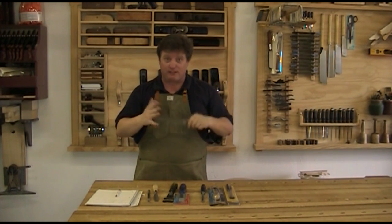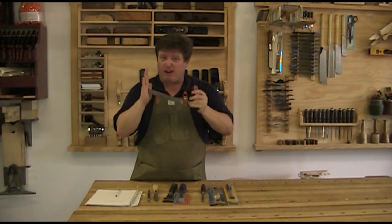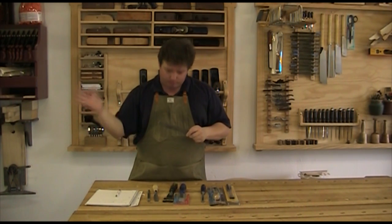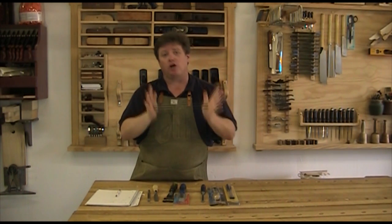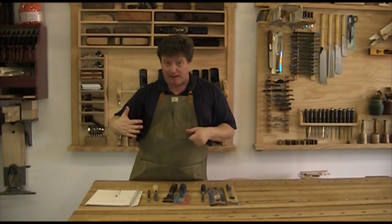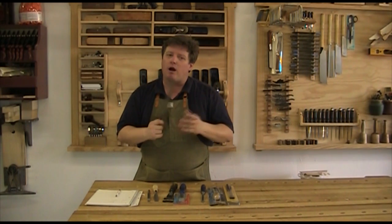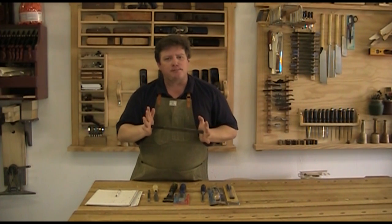Well, we need to soften steel up enough so that we can abrade it and sharpen it. Because this file, you would never be able to put an edge on it. It's just way too hard. It'd actually destroy the diamonds on my sharpening stones. I need to soften it, and I can do that by sticking this very file in the toaster oven at about 350 degrees and leave it there for about 4 hours and let it cool down slowly after that. I could go put an edge on it, sharpen it, and use it as a chisel. Easy peasy.